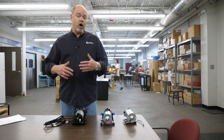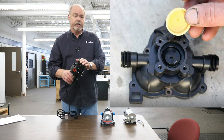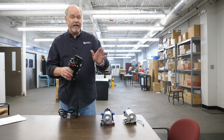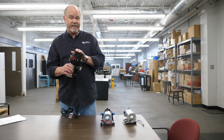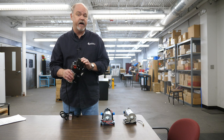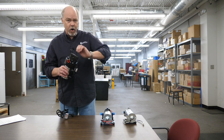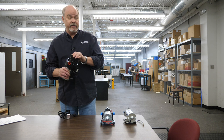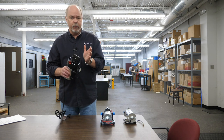Most of these pumps operate in demand mode, utilizing the pressure switch built into the top of the pump. As the pump moves water, when demand stops, the pump will keep running for a moment until it reaches the pressure switch setting. For example, a pump with a 65 psi pressure switch will keep running after the faucet is turned off until the line pressure meets that shutoff setting, then the motor shuts off.